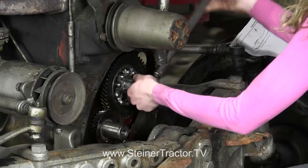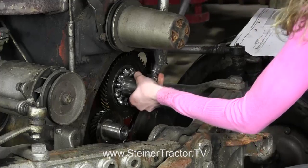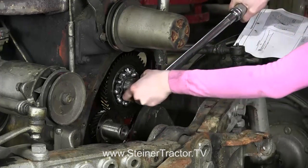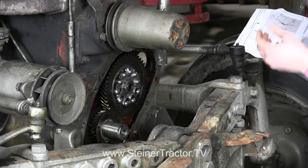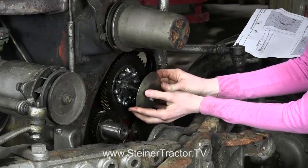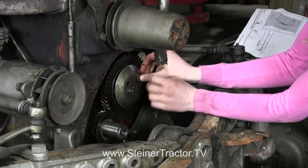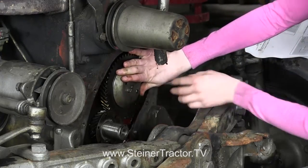The next step is to put the cover back on. The cover has a lip which is important that you put into proper place. Here's the lip on your new cover and this is important that you get it in position as well. It needs to be at about 8 o'clock with your lip there. Don't do it at 6 o'clock or 7 o'clock because when you start the tractor it will break off. So make sure you get that at 8 o'clock, tighten it in there, and then we're ready to proceed.